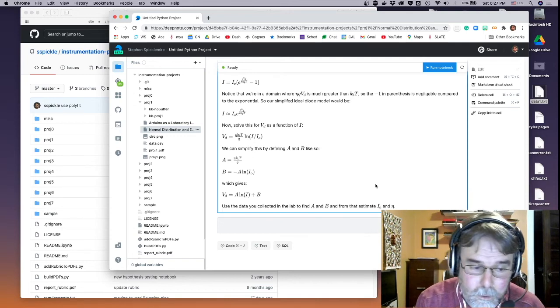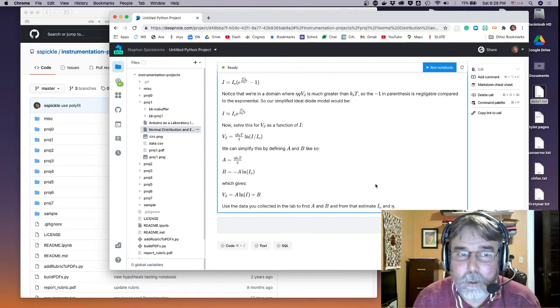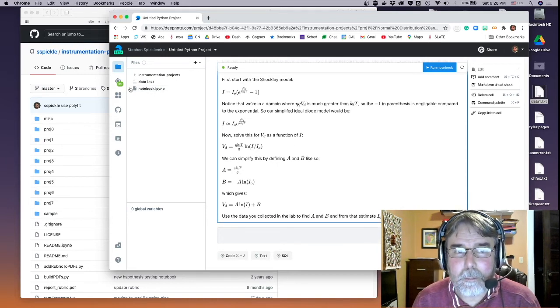Just to confirm, I did a git clone of the actual repository. Looking at the notebook for the exercises, A is correctly defined as the coefficient out in front — basically the stuff that divides Vd. The two parameters we need to measure for the Shockley formula are I₀ and eta. Those can't be looked up — you have to measure them experimentally. That's the whole point of this experiment.